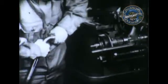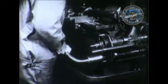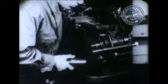The hinge handle is the most commonly used and probably is the handiest for the usual job. The L handle is used on heavy work and will withstand more pressure than other type handles. The speeder handle is used for the purpose the name implies, where a large number of nuts of the same size are to be run on or removed.